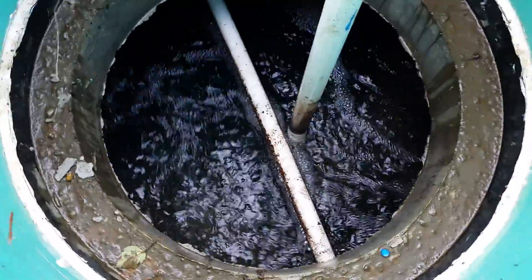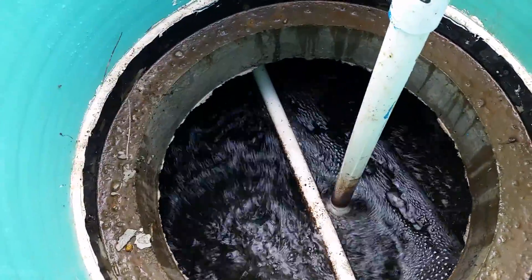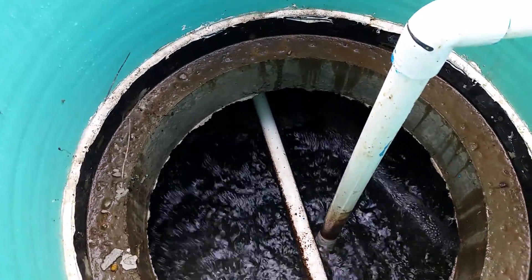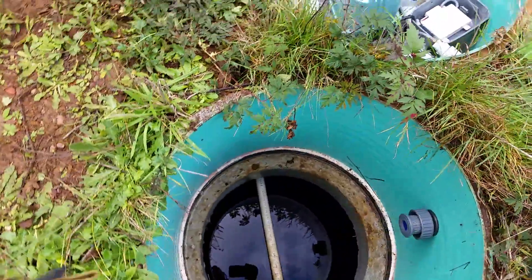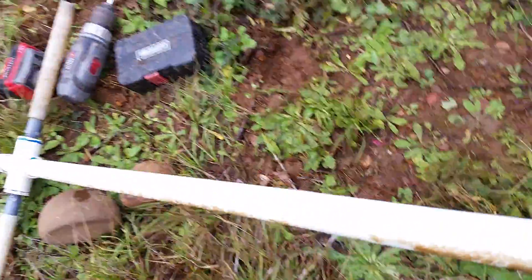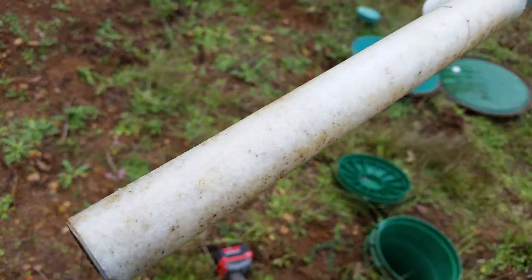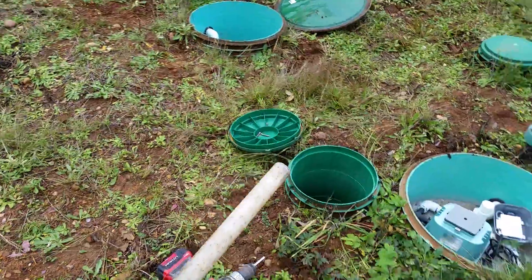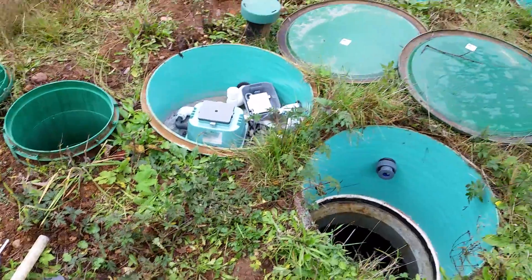Here's where we have the stone emitters causing the circulation and feeding the aerobic bacteria. Down in this tank we have a dissolved oxygen of seven. I've disconnected this one to show that we need to remember to clean the emitters — these are just stone emitters. If you don't clean them, they get full of biological growth and gunk, and instead of getting nice fine bubbles we end up getting coarse bubbles, and then the plant starts stinking and getting sick.